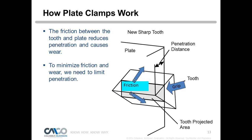In the event that you have a clamp that does not have that, we do a simple recommendation: we use the 20% minimum loading rule. Let's say, for simplicity, you have a clamp that is good for a max working limit of 1,000 pounds. We'll drop a 0 off the end and times it by 2, so your minimum loading would be 200 pounds on that clamp. That's how you would do it if you didn't have the minimum loading on your clamp. But excellent question. Okay, thanks. You're welcome.